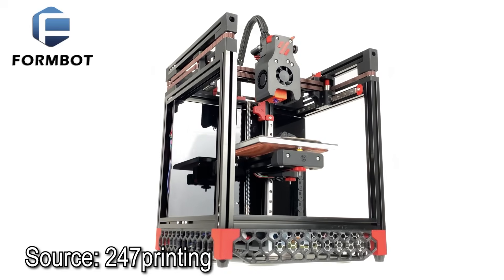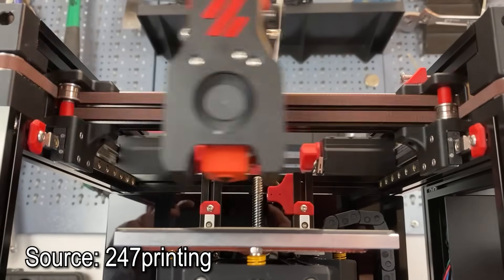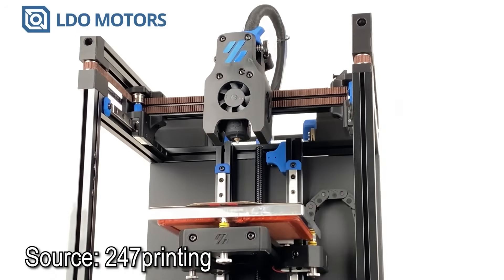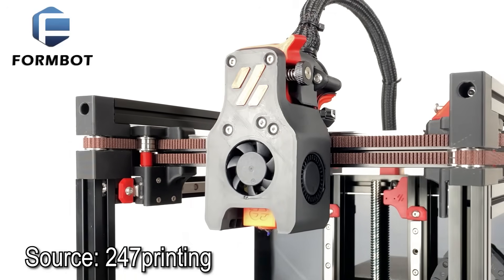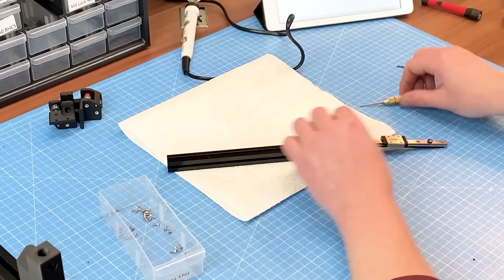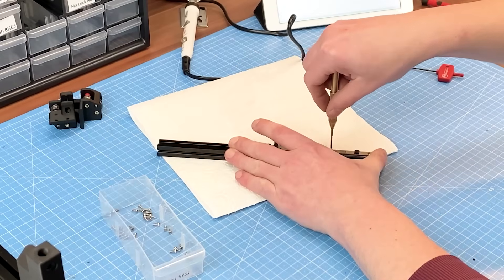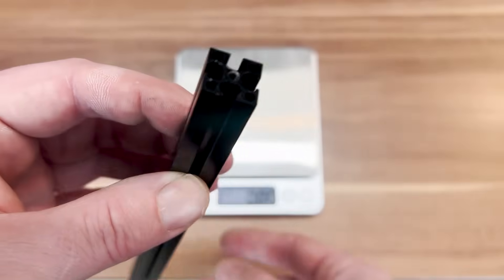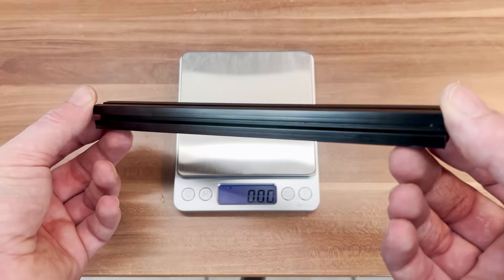For all the tests on these X-beams in this video, I use a Voron 0.1 built from a FormBot kit last year. Make sure to check out my video series comparing a LDO and FormBot kit. The majority of users built the Voron 0 with the Direct Drive Mini Afterburner toolhead, which is considered the default option. A Voron 0.1 is specified and built with a common 15x15mm aluminum extrusion for the X-axis. There are many viable reasons for the use of extrusions like these — they are widely available, they grant flexibility for mounting, and the mechanical properties are more than sufficient for the task.